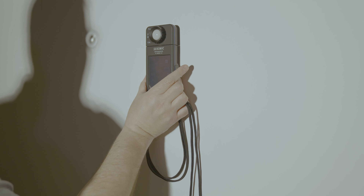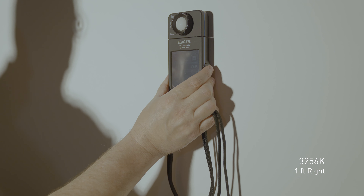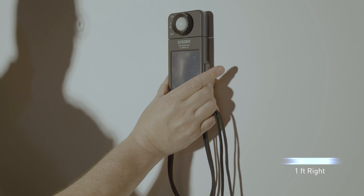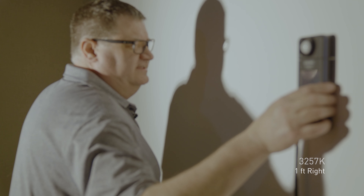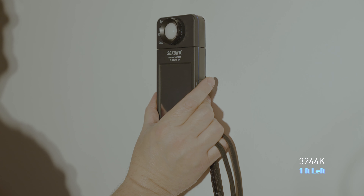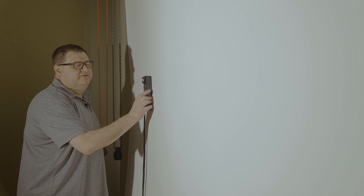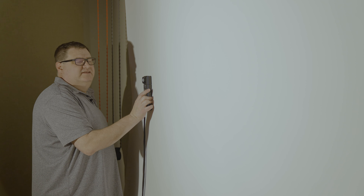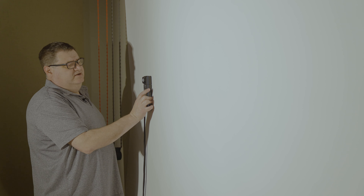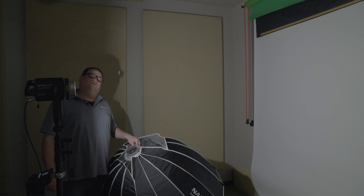Let's do the right side test. First reading: about 5,841. Second reading: 5,838. Jumping to the left side: 5,804 and 5,803. So we're around 5,800 all the way across the beam angle with the reflector. This allows us to know that because we're plus or minus 200, we're still kind of within the range we need for 56. But we definitely know with the reflector we're getting a higher color temperature.